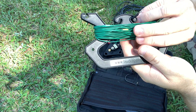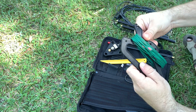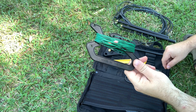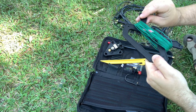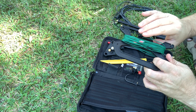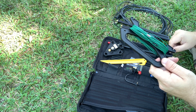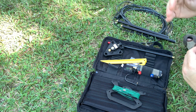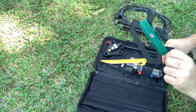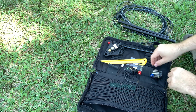The elevated radio wire has markings on it that you can see throughout the wire. Those are your approximate locations for the different bands, pre-marked to get you in the ballpark. I do highly recommend a nano VNA or an analyzer — a Rig Expert stick, MFJ, whatever analyzer you've got — it'll make life a little easier getting this thing tuned. But with the pre-marked areas, it's not necessary if your radio has a built-in SWR meter. The IC-705 or IC-7300 have an SWR function — you get it close, see where it dips, make your adjustment. You don't absolutely have to have an analyzer.